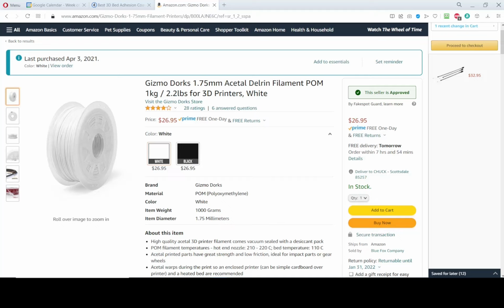Hey everybody, welcome back. If you watch my channel, you probably know that I have tried a number of different ways to print with the POM or acetyl Delrin filament. While I can get the printer to print with it, I can't get the print to stick to anything. I have tried everything I have and everything I could easily buy or order, including a Delrin sheet, and it wouldn't stick to Delrin either, even though that seemed to be the closest I got, but still it would not stick to it.